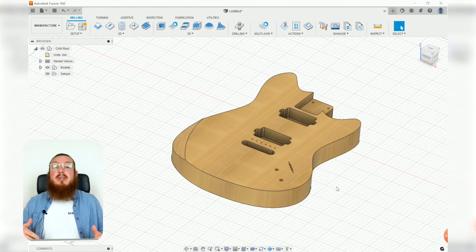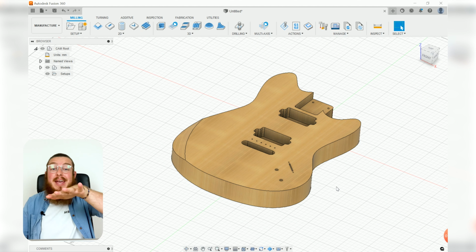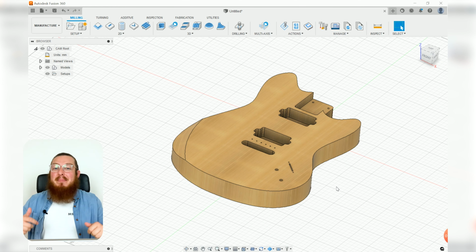A lot of people will put different dowels or different registration pins so their board is exactly in the right location when they rotate it, or in the right location, just reversed. Some people have different squares already built into their CNC so they can push it up against a frame. We're going to be skipping all of those and just assuming that we can rotate and bolt it and it will be in the perfect location.